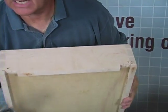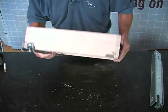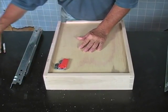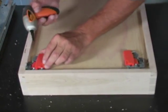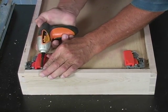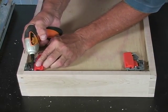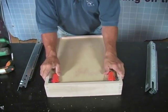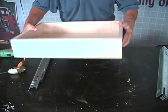Now our slides — that's how they lock into the back; they lock into that pin right there. What we have to do on the front on the inside, in order for these slides to lock, is these little clips that come with the slides. There's a little jig you can use to drill the holes, but I just take and push these in here freehand at a little bit of an angle and screw those in. Our drawer is all set now. The slides are already attached in the cabinet — we'll take it over to the cabinet and see how it works.